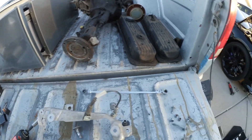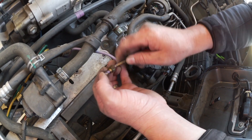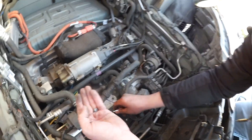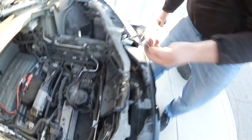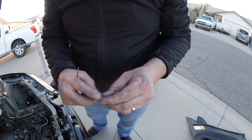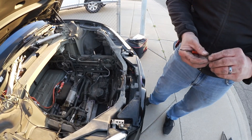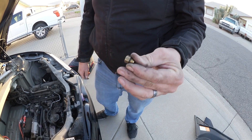We'll pull one off of the air line. These are supposed to be one-time use — there's a small clip attached to them. But you can loosen it with a screwdriver and possibly reuse it if you don't break it. The new compressor already has one, so that's good. You can see the beveled edge — it sits against the beveled edge, presses, and closes. That's what actually holds the air line in place. You need one for the black one as well. The new compressor has new ferrules and new sealing nuts in it, so we're just going to use the new stuff.